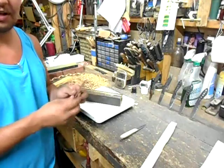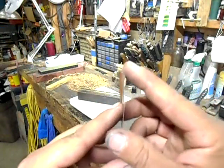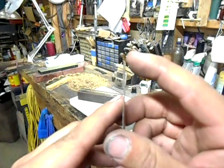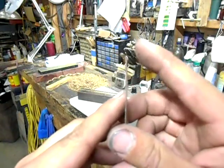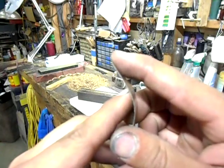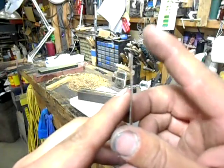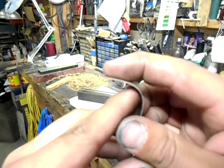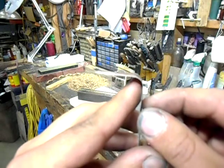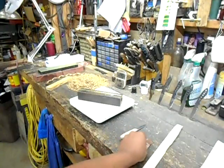In the case of our aluminum shim stock, with very light pressure it will flex and come back to true. Increase that pressure — still comes back. Increase the pressure — still comes back. Increase the pressure further and at some point it will take a set and remain bent over. The same thing with the wood and so on.